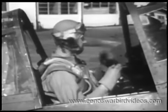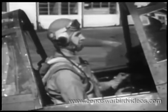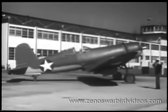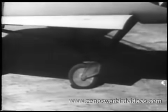As you go up in horsepower and performance, it becomes more and more important that you take nothing for granted. You must know all about the controls, operating mechanisms, and power flaps. There are more than the usual number of hydraulic devices, and you need to be familiar with their functions. The cowl flaps have no indicator, but you can see their position from your seat. The intercooler flap position can be seen on the indicator, because the position is impossible to see from the cockpit. The same is true of the oil cooler flap. The three-point attitude of the airplane on the deck will vary, depending on whether the tail wheel has a pneumatic tire or one of solid rubber.